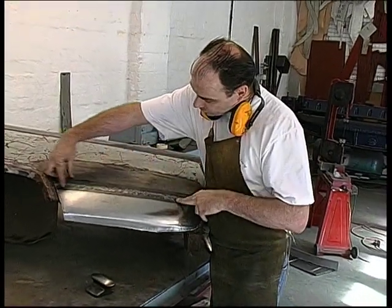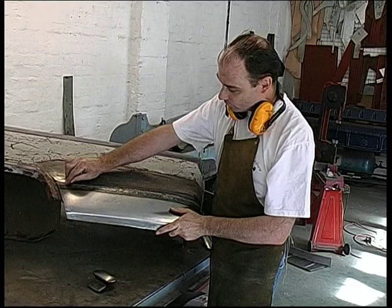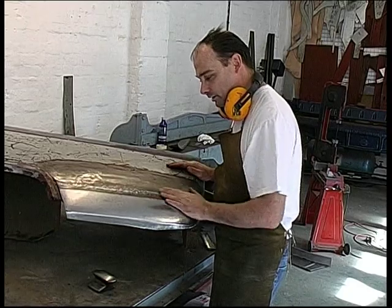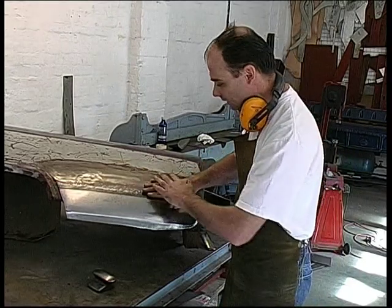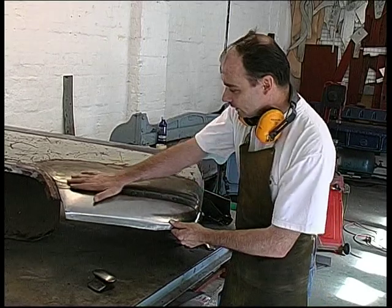You need to concentrate on the area of the weld, because obviously all the distortion actually hinges from the weld. So I've planished all across the weld. I use my hands and my eyes just to check the shape of the panel. Look along the panel, run your hands along the panel. Your fingers should be slightly spread. Hold palm of your hand and your fingers on the panel and run it along, and you'll feel any distortion